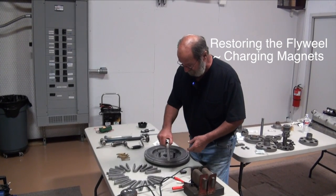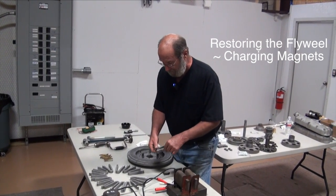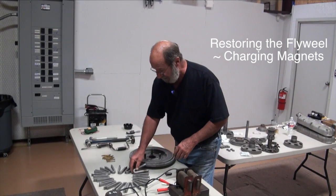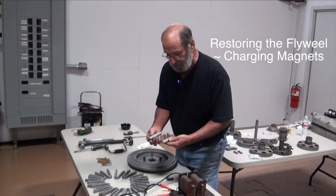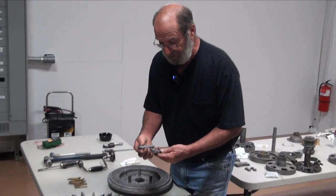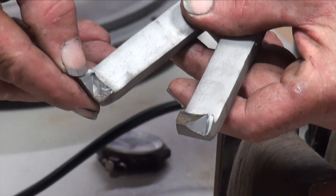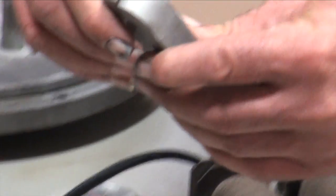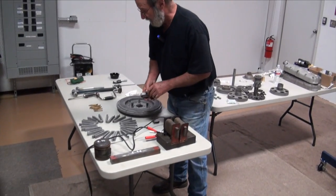The other thing that I do is visually look for any cracks. I'm going to wrap them real hard up against a piece of steel, and as you can hear they ring really nice. I'll go through the whole set — unfortunately, off camera this one kind of made a clunky sound. I hit it again a little harder, and you can see that there's only a little over an eighth of an inch of material. Even though I couldn't see the crack in it, it was split and it broke, so this magnet needs to be replaced.